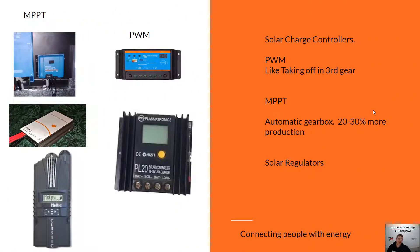Moving on from solar panels, the next thing is a solar charge controller. There are different types of solar charge controllers. We've got our racking on the roof, put our panels down, and run cabling down to our solar charge controllers. On smaller systems, PWMs are lower cost — they're pulse width modulators. They pretty much turn your solar panels on and off. When your batteries are full, they turn off. When the batteries drop down a bit, they turn your solar panels back on. Pretty simple — that's why they're low cost.